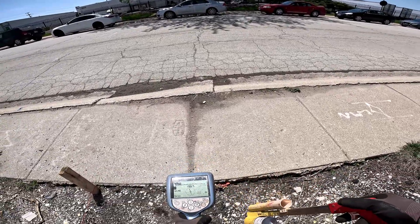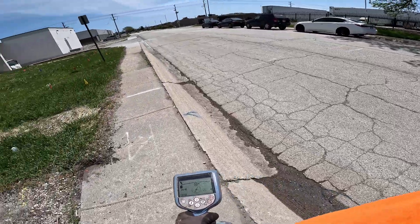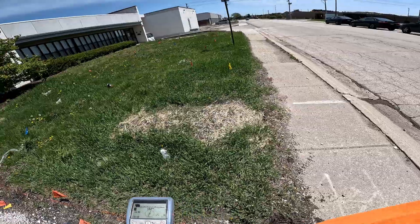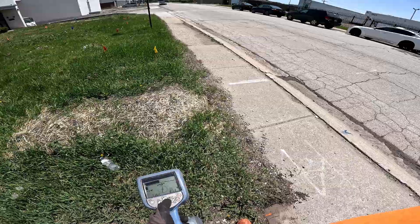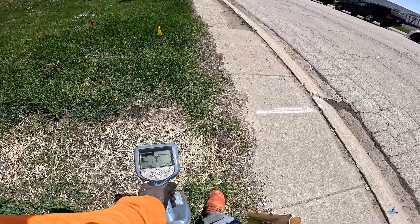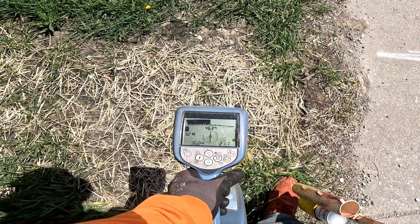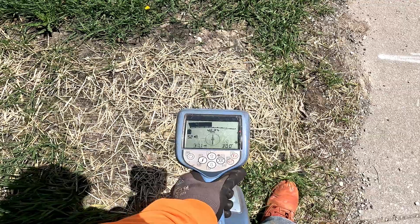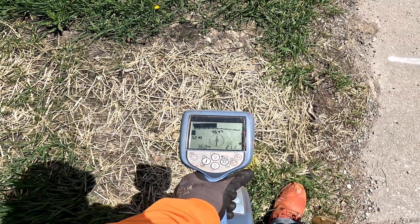You can see where I lost it — it stopped. Picked back up here, so I bumped up my gain because there's resistance on the line. I bumped it up a little bit. Checking it: 36-37 milliamps, 211, three feet — that's about right, compass straight. So I bumped up my gain just a little bit, not crazy with it. I'm at 52 percent.